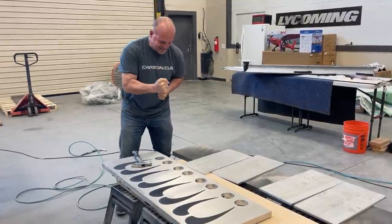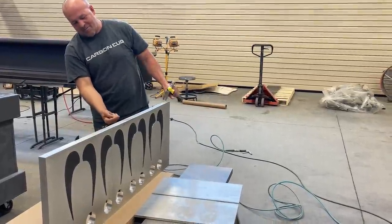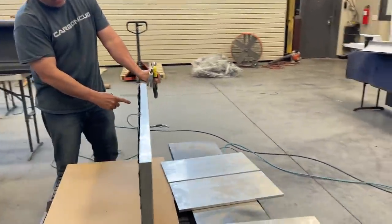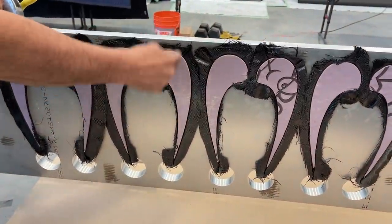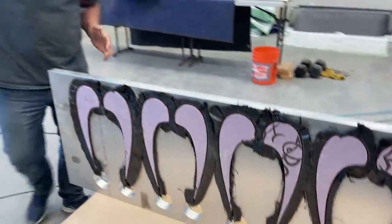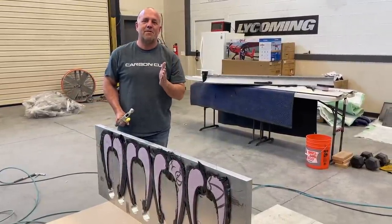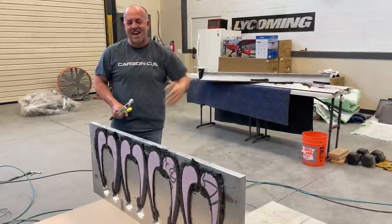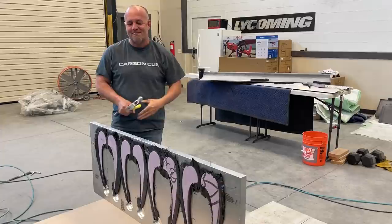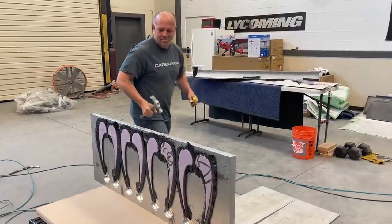Wish us luck. I'll do the next batch different because when I overlap this side, if you look around this edge, the messy side, I meant to go through and cut with a pair of scissors the carbon and make sure they didn't touch each other. So not only do I now need to pop the pieces out of a zero tapered mold, but I gotta pop them all out at the same time. It was at this moment that he knew. Rather than one at a time, so I gotta work my way down and back. I'll get it, just give me a couple minutes. A little longer than a few minutes later.